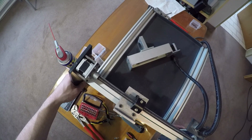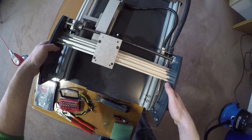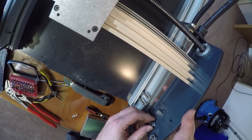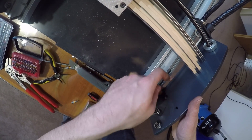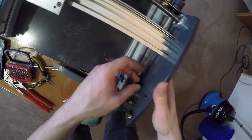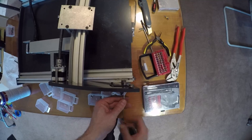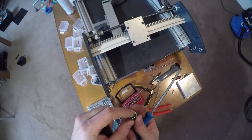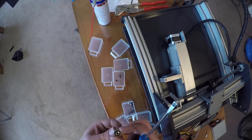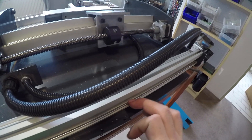The weight of the Y sled is held by four track rollers, and that seems reasonable enough. But if the package has been turned over during shipping — and I'm almost certain it has — then the weight of the entire bottom section would have been held by two eccentric track rollers. And since they are more bumpy than my 80-year-old roller skater bearings, I'm almost certain that is exactly what happened.